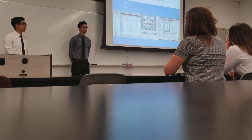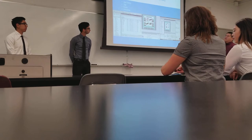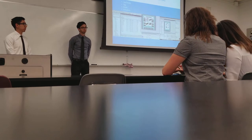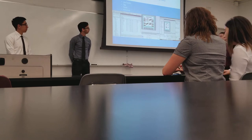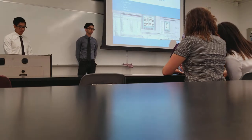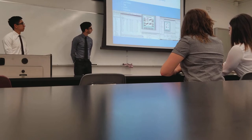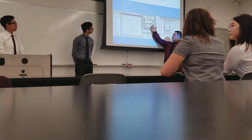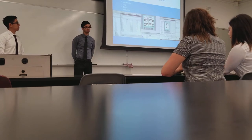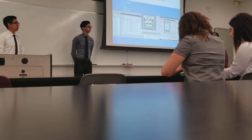The HMI also had its own dedicated tag table, so we were essentially linking an HMI tag with a PLC tag, keeping them in sync. This made it easy to track all internal markers, inputs, and outputs. On this screen you can see all the buttons, each with events as they're called in the software. The click event can activate a screen, and when a button is pressed or released it sets and resets bits from the tag table. This software is industry-standard, used with both low-level and high-level Siemens PLCs.